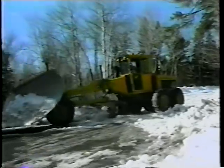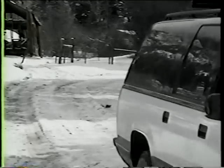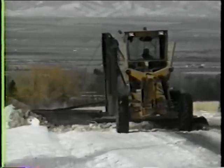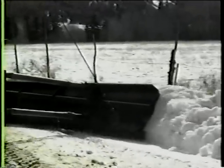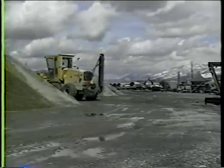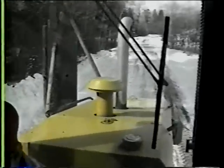It is also important to be able to see some of the shoulder behind you. It is helpful to motorists using a newly cleared road as a guide to keep them from running off the road. The wing should be casting the snow out onto the ditch without leaving a windrow to catch future drifting snow. If the ditch is already full, raising the heel of the wing so as to leave a gentle slope upward at the edge of the road will minimize future drifting. The speed at which you travel influences how the snow moves across the mold boards. Too slow and you are a bulldozer; too fast and you crash. Considering your visibility and your own comfort level, maintain a good speed to keep the snow moving across your mold boards.